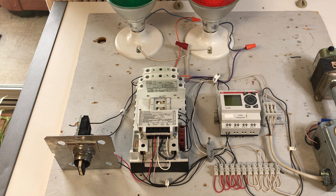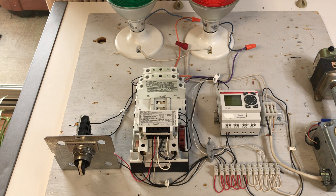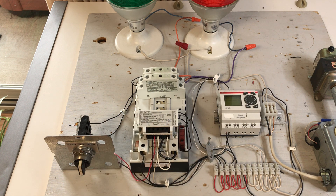We'll follow the manufacturer's schematic to wire the 2-wire control for our functions. We have a hand-off-auto switch here on the bench. When we switch this to hand, the control supply input is switched on at P2 on the contactor. After this is commanded on, it's sensed by the microcontroller of the electronic control module to ensure it's a 50 or 60 hertz signal.